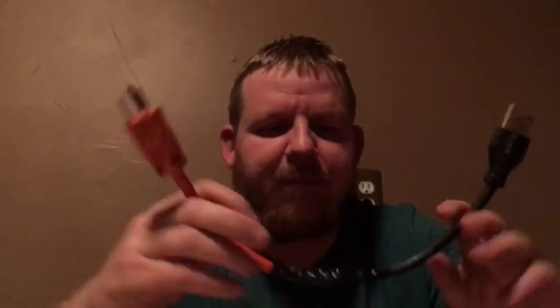To make this plug, it's pretty simple. You take two male ends — make sure it's thick gauge wire because all your power is going to run through this one cord, or you might have multiple cords to run different circuits. When you open it, it's all color coded, so you just match up the colors. Tape it and solder it — you don't have to solder if you don't have a soldering gun, but I did. Put electrical tape around it. You can basically do this for free, or you can buy nicer plugs if you'd like.